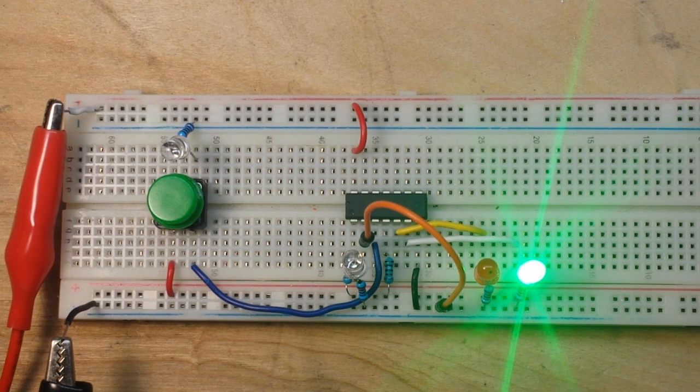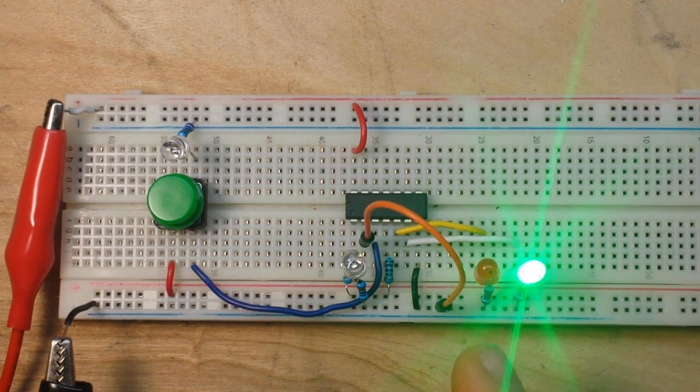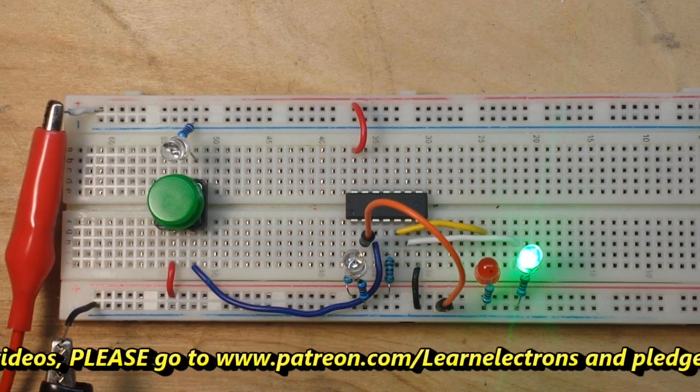So basically what we have is a latching flip-flop — think of it as a one-bit memory. It's also used as a high-low switch in a couple of applications. The output, or the memory of the flip-flop, does not change until it's been clocked. You can change the D input high or low; it doesn't matter — until it receives a clock input, nothing changes. There are other flip-flops such as the JK flip-flop that we'll get into later. This is the D-type flip-flop, also called a delay flip-flop. Hope you guys enjoyed that — please give me a thumbs up, feel free to comment, share, and don't forget to subscribe.